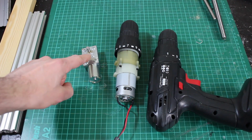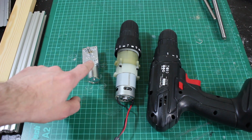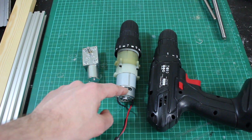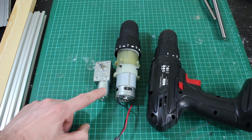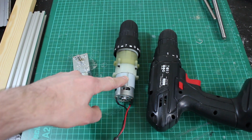These are the motors I used last time, and as I mentioned, as we scale the droid up, it gets bigger in 3 dimensions, so if it were twice as tall, it'd actually be 8 times the volume. So I'm going to use much bigger motors, and of course having bigger motors makes it much heavier as well, so there's more mass to move. We're making it about 30% bigger, but my motors are quite a lot bigger, and these are going to be drill motors driving lead screws or ball screws.